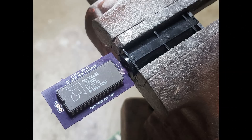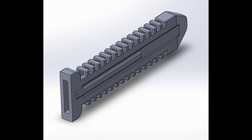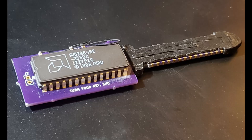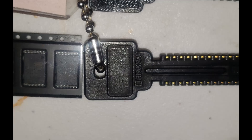A bare PCB does not easily slot in, but with a little jiggling I was able to get it to fit. Unfortunately, it didn't work. After a little debugging, I discovered I had swapped two pins and it came to life. Next, I 3D printed a sleeve to go around the PCB. This was a bit tricky due to removing the extensively blocked support material, so the initial version removed the teeth from the side. However, eventually I was able to get the model to fit together. The completed key is now significantly easier to align and also prevents backwards insertion.